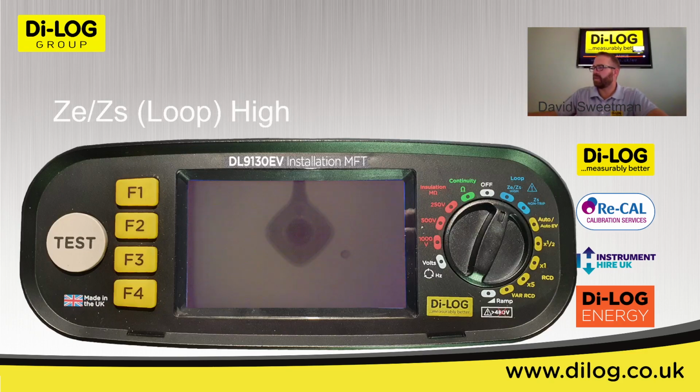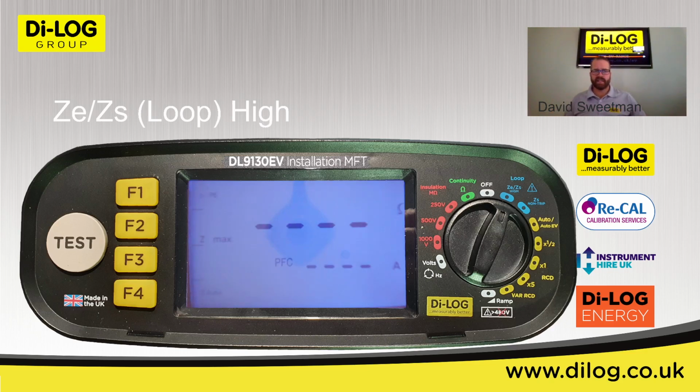And again, other standard functions within our tester, and again, some new features that we've introduced as well. So we've got 2 and 3 wire loop testing at high current as well, but it's intelligent, so it knows whether you're using a 2 or 3 wire connection. By using either 2 wire between live and earth or 3 wire connection, the tester will say if it can safely take the measurement and it's got a path that it can take for that particular measurement, it will do it automatically, and there's no switching between 2 or 3 wire.